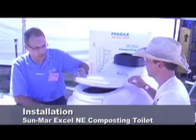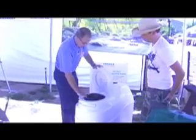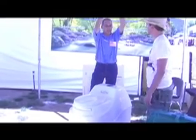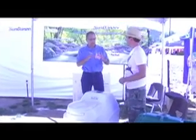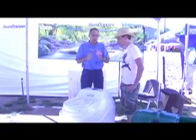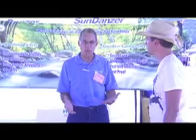In terms of installation, it's very simple. Our self-contained units arrive fully assembled, as you see it here. There is a vent stack to hook up. For our non-electric models, it's a four-inch stack installed straight, and the breeze passing over the top of the stack is what creates the draft. We use a diffuser rather than a wind turbine of any kind, because if there is no wind a turbine will actually block the venting. The diffuser has an outer ring that channels rain away from the stack so it won't fill up the toilet.